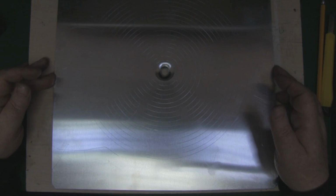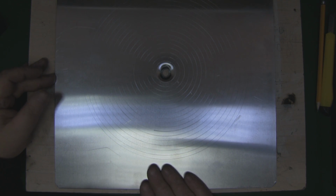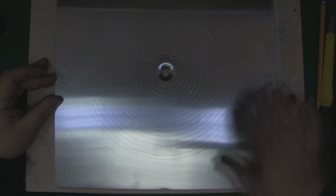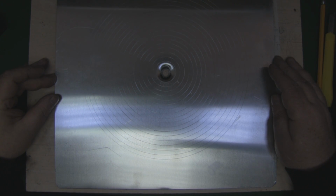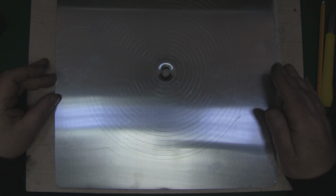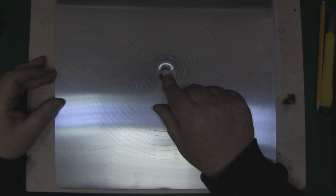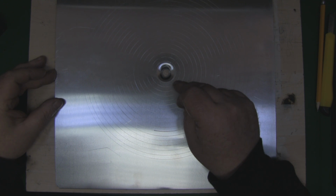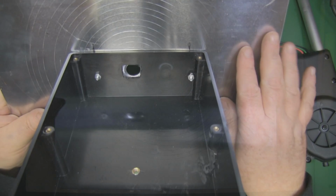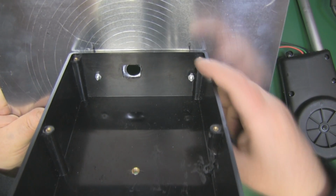Now for the reflector for the helical, what I've got here is a plasterer's hawk. This is actually aluminium sheet, and I only paid about £8 for this from a local hardware shop that's close to me, but you can pick these up off eBay even cheaper than that. So what I'm going to have to do is make this hole a little bit bigger so I can fit the automatic aerial through, and also work out where to drill a smaller hole so I can actually connect to the helical antenna itself.